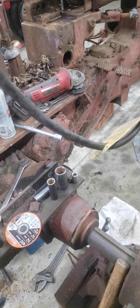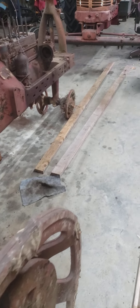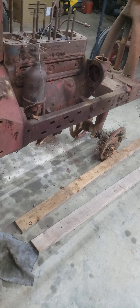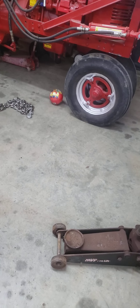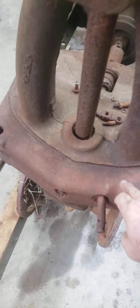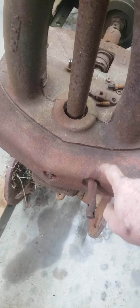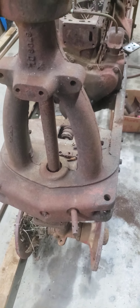Part of the brake system is still there but not very much is usable. I'm going to save the tricycle and probably that front bolster. I had to have a tricycle here last year for that H right there and used up the last one I had in my parts stash, so I'm going to replace and save that one for next time. I have seen these bolsters break — I saw one on an M that I actually replaced that was busted right through. Apparently that's the weak spot coming through by the old start shaft.